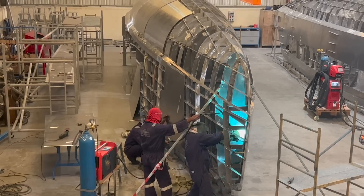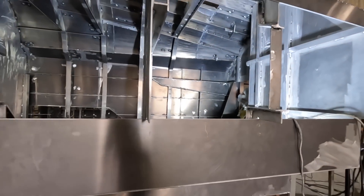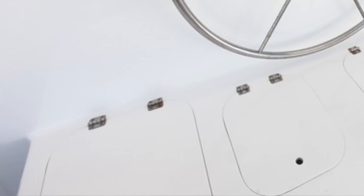Where the bulkheads join in aluminium is actually stronger than the flat aluminium itself, because where you have welding you're adding extra aluminium and it creates a rounded fillet. When you use glass into a square corner, you round it off with epoxy and make a curve - that curve creates much better strength and is called a fillet. When you have a weld, you're filling in that right-angle corner with metal, creating essentially a small fillet. That's why it's said that where there is a weld in aluminium, it's actually many times stronger than the aluminium itself.